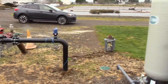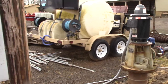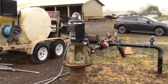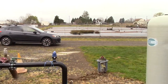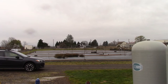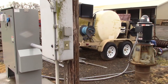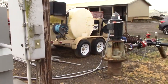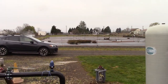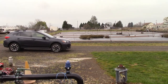Once the pressure in the tank gets full again, the electrical controller on the left will turn off the pump. So you've got two things happening: people are opening valves out in the field, which makes water leave the irrigation system, and the pressure tank drops in pressure. The two components work together — the controller on the left turning the pump on and off to balance the pressure in the pressure tank as it's lost to the field. When irrigation stops, the pressure tank is full, and the pump will stop cycling because the controller senses the tank is full.